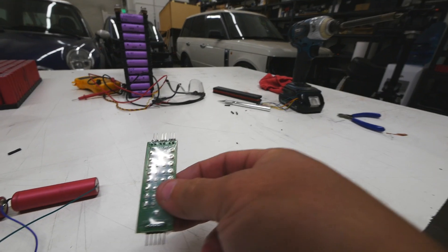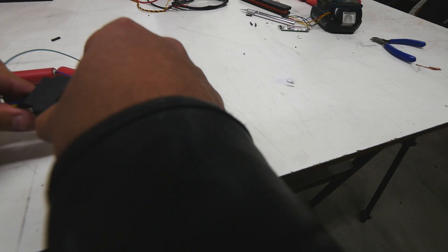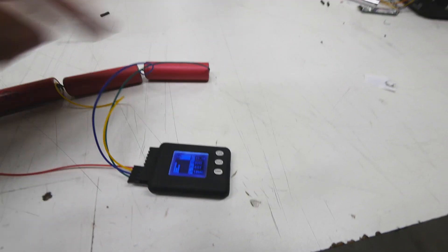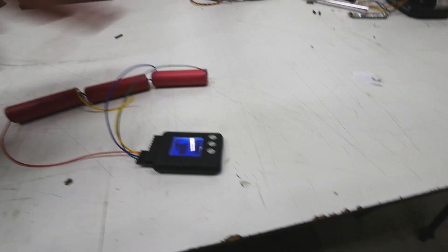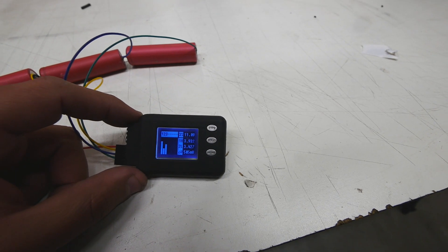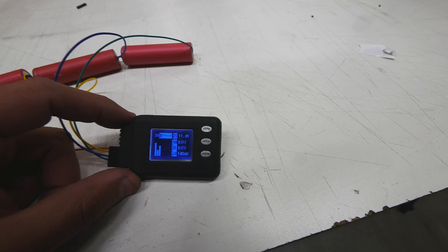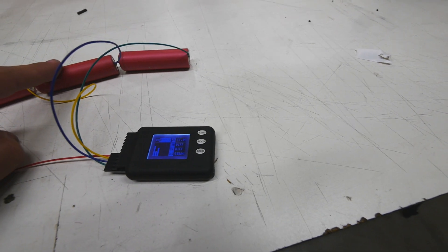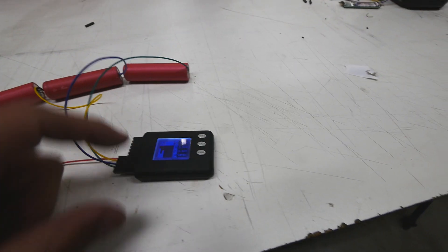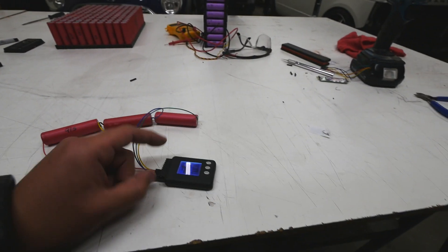You could use something like this — check this out. This is just a meter that tells you how the batteries are doing. This one's a simple little device that shows you each battery's voltage. Oh wait — that's why I was plugging it backwards. Check it out, this little thing shows you exactly... these batteries are not balanced. See, it's showing 11 volts total, with a difference of 500 millivolts — so half a volt off. The center one is the lowest, this one's the highest, this one's the second highest, and this one's the lowest. This stuff is off the shelf, it's like 20 bucks, you can buy it online.